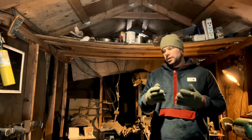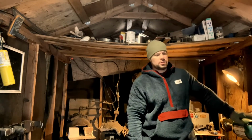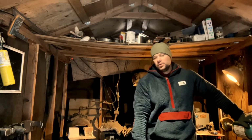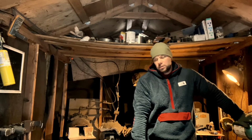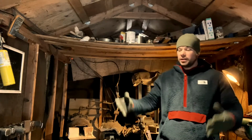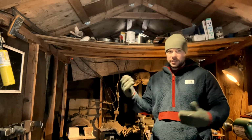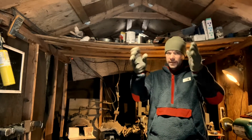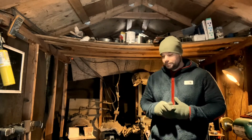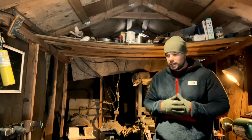Basically I would just be prepping while I'm working, so I don't have to do all the forging of it. I can still produce a Damascus knife on the job site somewhere, or when I don't have a lot of time to forge. I already have the billet ready to go, so all I have to do is stock remove a knife out of it, or forge the knife out, grind it, and heat treat. I can do all that stuff out there. Heat treat I still do here at home, but that's simple. Other than that, that's all I can really think of right now.